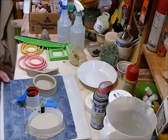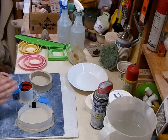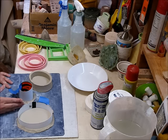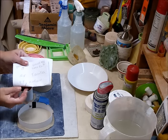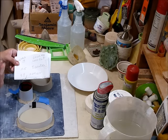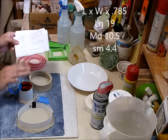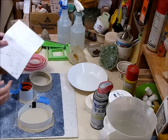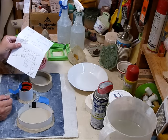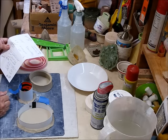So this part is ready — I'm now ready to do my pours. Before I show you the other form, I want to focus on the ovals and what I need for plaster. I did the math: I need 19 cubic inches for the large oval, 10.5 for the medium, and 4.4 for the small. Altogether that's 33.9 — I'll round it up and say 34 cubic inches. That's an important number for later.